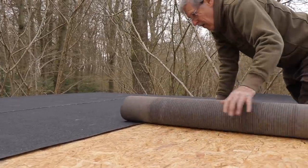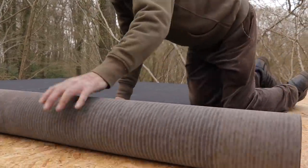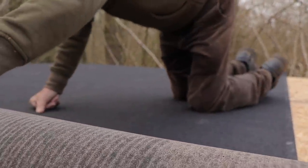A lot of people said, why don't you do some kind of shingles, cedar shingles or shakes. I say cedar, ash it would be. The problem is that the pitch or the angle of the roof is so flat that water would just get through them. I think you need a minimum, I want to say 12 degrees. You've got to have a certain degree for the water to run off. You guys would probably know more than us. But we weren't going to go with shingles on this.